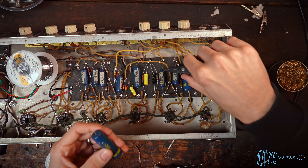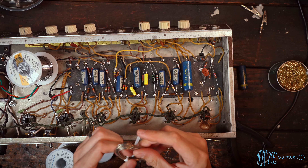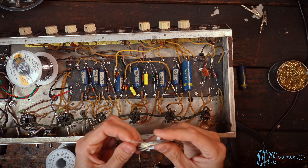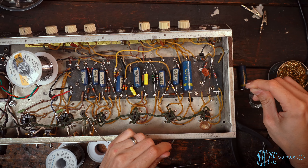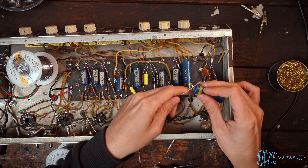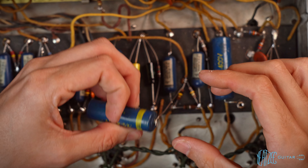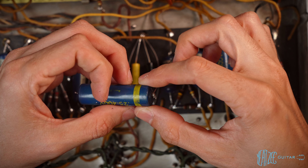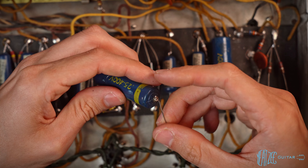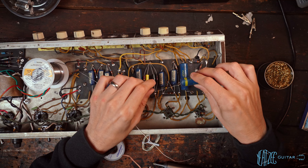We're going to have to do extension leads on both of these, just like we did on this one, but this is a very short nub here. I'm actually going to use a smaller bus wire than the original lead — I think that'll help because I'll be able to get a nice wrap around versus trying to work with those little right angles. There's just not enough space between the cap and the lead. That way I can get a full loop around it — so it's really sturdy. I'll go ahead and solder these together so they're not separating, and then we'll have this be the lead. It's not the prettiest thing in the world, but it will be secure.